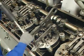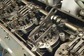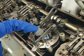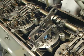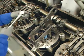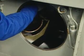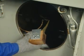Disconnect the overhead hoist. Remove the lifting clamp and the piston holding tool, and place a clean rag into the injector well. This will prevent dirt or other loose objects entering the cylinder before the injector is applied. Remove the connecting rod positioning clamp from the fork rod.